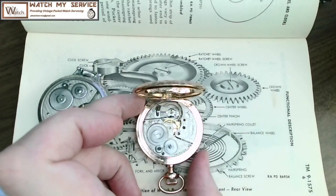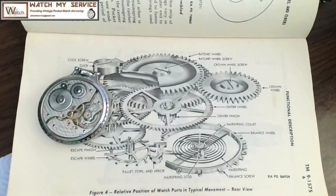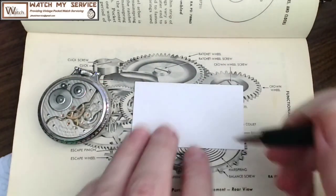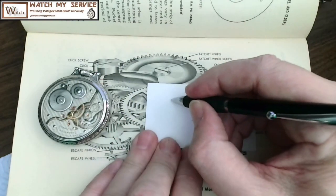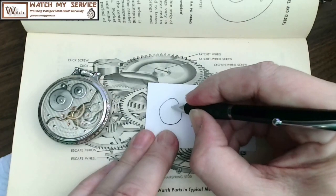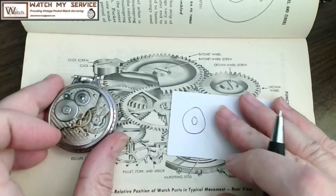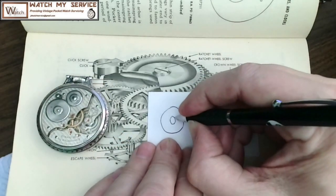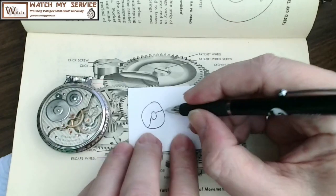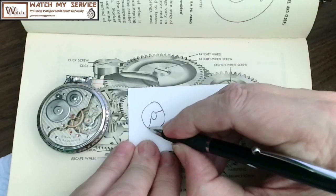It was just worn. So, let me just draw a little picture for you here, because when you're looking at diagnosing watch issues, by the way, my wife loves it when I draw these little pictures. So if I have a jewel, this is my jewel here. Say I got a jewel here, and there's the jewel hole. And I say I've got a couple of conditions here. When I look down with my stereo microscope at the jewel, and I see the jewel has a crack in it like that. And usually it's cracked on both sides, because the crack here will cause stress in the overall jewel and cause it to crack on the other side.